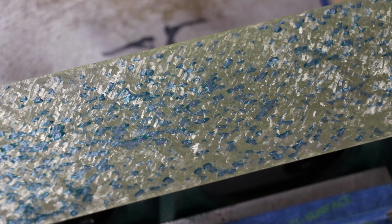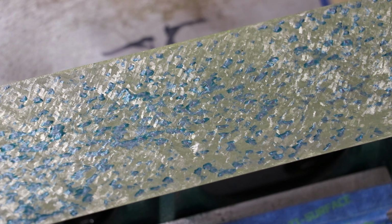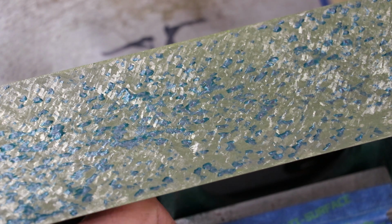All right, guys, it is bluing up really nice. I'm still not 100% satisfied where I'm at, but I'm at a point now where we're probably going to stop on this side, and I'm going to flip over and start working on the dovetail up underneath this edge here. Same process as we just did, but we're going to work on that surface. It's very likely that as we remove some material off of that dovetail it could change the bottom just a little bit. So I'm not going to take it all the way down.